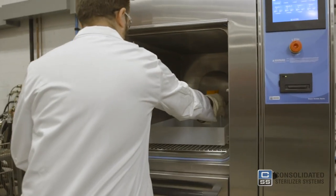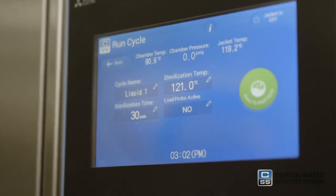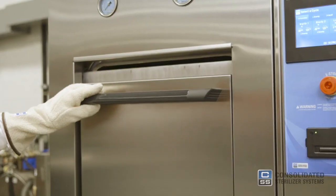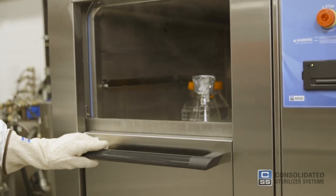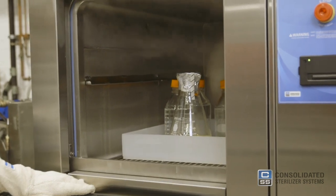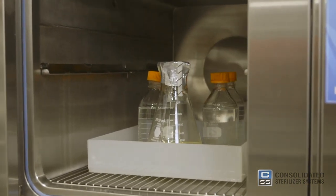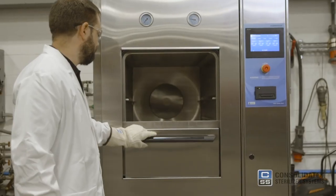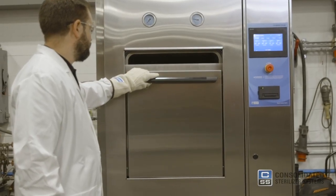Additionally, here is the liquid cycle. As I mentioned previously, load the liquids into an autoclavable bin, shut the door, select your cycle, and hit start. Once the cycle is complete and the autoclave temperature and pressure have dropped to a safe range, carefully open the door slowly to let the autoclave vent and the goods cool. If there's a fume hood above the autoclave, make sure it is turned on. Be careful not to agitate any liquid containers or remove caps while unloading, as this can lead to scalding or burning from boiling liquids. Place all goods in a clearly designated area and allow them to cool to room temperature. Close the autoclave door once complete, as this will help save energy since many autoclaves have steam flowing in the jacket throughout the day.